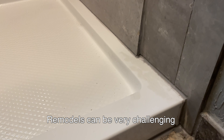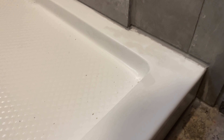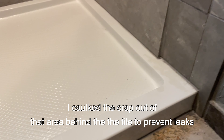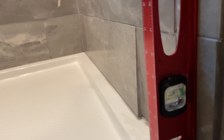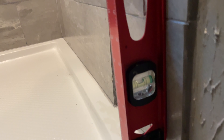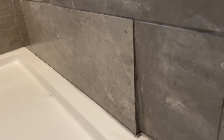This doesn't look great — you can see it crops up — because the lip on the end of this shower pan is behind it. I cut it out of this area here, which I really didn't want to do, but it needed to be level. Looking at the level here, it is within the lines, and it has to be level in order to be parallel with the opposite side for the shower door to sit in there. I could have taken all of these pieces out for better aesthetics, but I was concerned with leakage, so I just let it go.